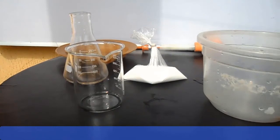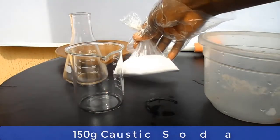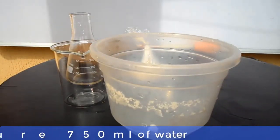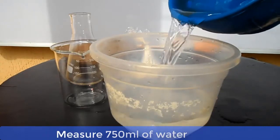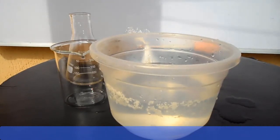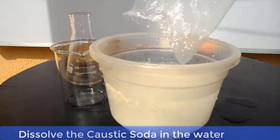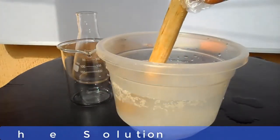We are now into the preparation proper. We are preparing a lye solution for making toilet or medicated soap. Here we have 150 grams of caustic soda. We will start with 750 ml of water, so let's measure 750 ml of water and dissolve the 150 grams of caustic soda in the water. The benchmark for our hydrometer reading should be 1.250 — that is the ideal benchmark for making toilet or medicated soap. Now stir the solution properly.